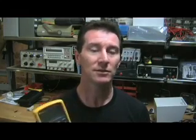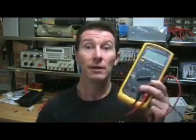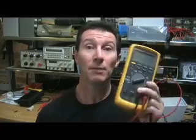360 millivolts may not sound like much, but if your circuit is 5 volts, you've already thrown your circuit out of voltage spec probably. Let alone a 3.3 volt circuit, or — I'm working a lot these days on 1.2 volt circuits. With a current like this, a meter like this, you really can't measure precision current with. It's crazy.